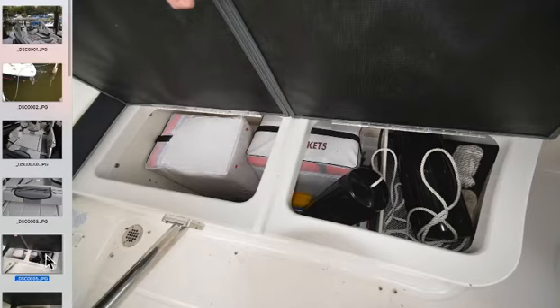Storage is all over the place. Note how this is guttered so the storage is dry — some builders do not gutter their storage and they really should. These hinges are called compound hinges; they're a little tricky to use the first time, but they allow you to hinge the cushion rather than having a fully removable cushion, because otherwise the backrest would keep the lid from opening all the way.